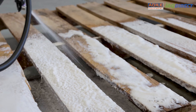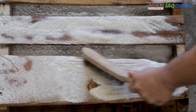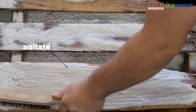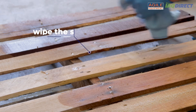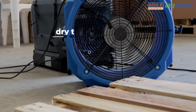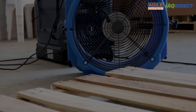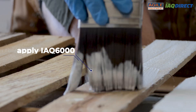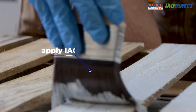Links for all these products will be in the description. On a microbial level, we then kill the remaining mold using our IAQ-pro SaniClean product to sanitize the area, agitating the product into the pores of the surface. Lastly, by applying FiberLock IAQ-6000 onto the surface, we encapsulate or coat any residual mold to help prevent further mold growth from occurring.